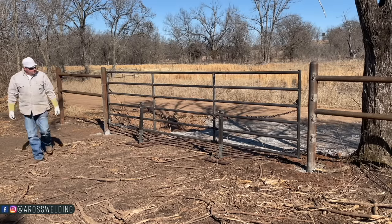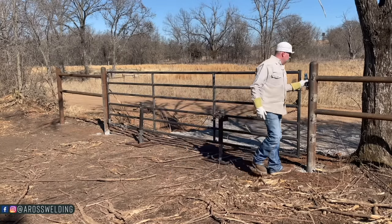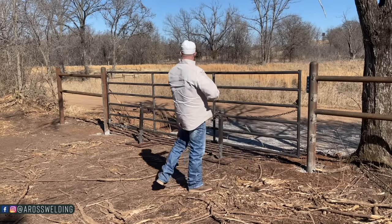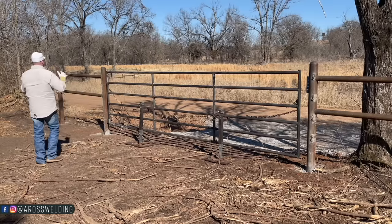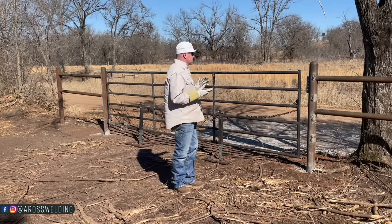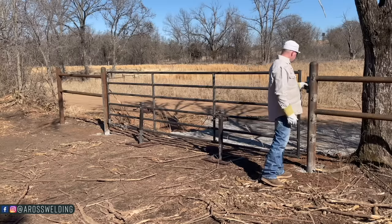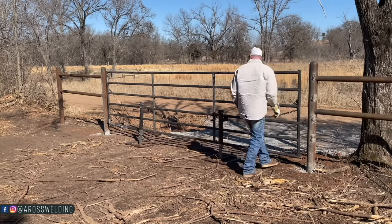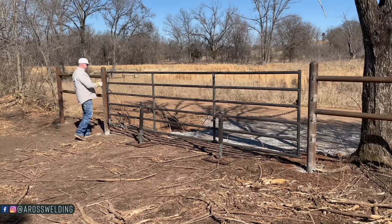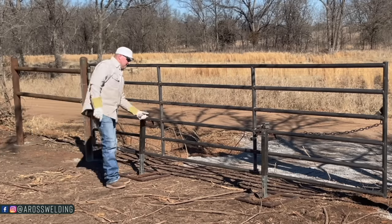I still need to go get a torpedo level, throw a level on these braces and on the gate. If you've been following, you know what we do on gates and braces — happy mediums. The reason for that is because the earth moves; sometimes when you're setting braces your post might settle, or if you're setting in concrete you might hit a rock, so your brace may not be exactly plumb. This post is leaning a bit this way and then pretty level that way. I just want to know what to expect whenever I go to put my level on my gate.